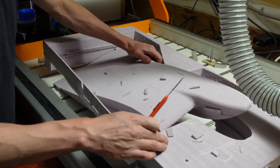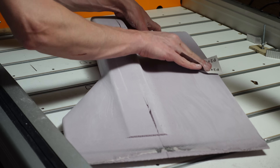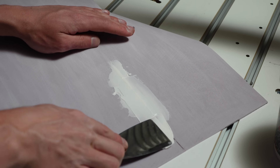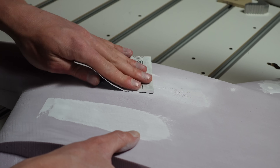I had to slice off all the little tabs that held it into the foam stock piece, and then gave it a quick sanding to remove any machining cusps. Next, I had to fill some cracks in the foam. Unfortunately, this foam comes with pre-cut snap points in it so that when you're using it as insulation you can chop it down to size more easily — not good for building planes.